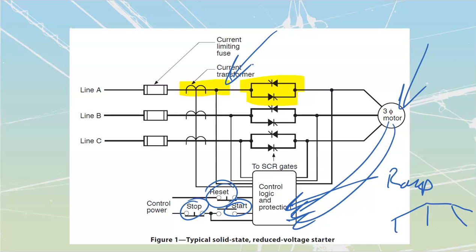We also provide electronic overloads inside. There are no actual physical overload relays, but by programming in the motor information and monitoring through the CTs, if we hit more than the rated current — operating with too much current — it's going to shut the drive down and give us an error light indicating the overload. We can also program the length of time we'll allow an overload to be present before requiring action.